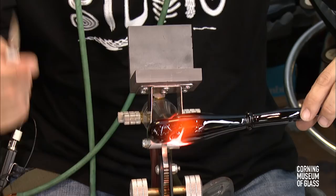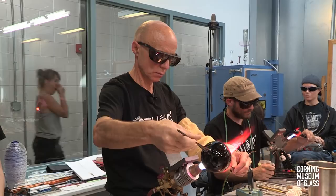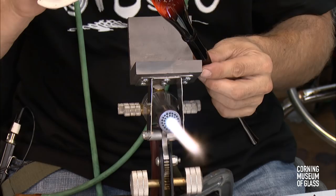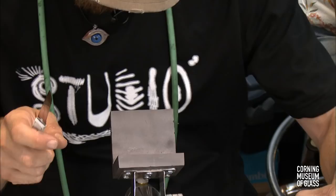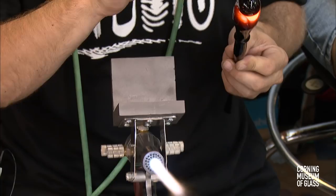No, we're just going to leave it open on the end. The very bottom. Yeah. If we put a hole in the bird's body somewhere, we could actually close this off and make it solid. You have to have one side open. You could either just poke a hole in the back with the tungsten pick, or heat up one little area and blow a little tiny hole out like if it were an ornament. You wouldn't want it out front to be visible, really.